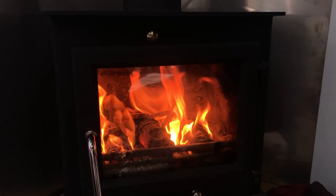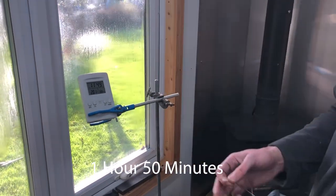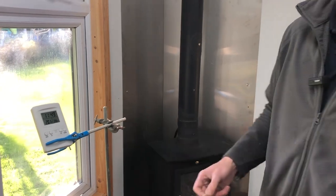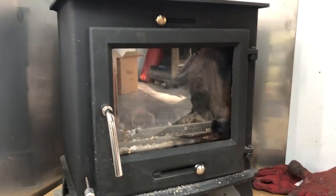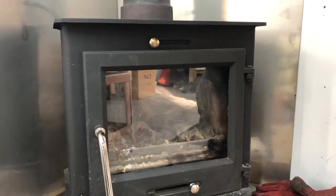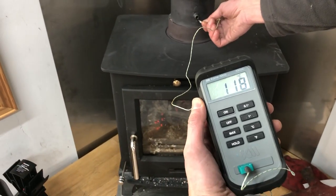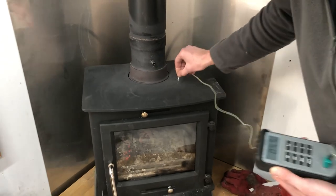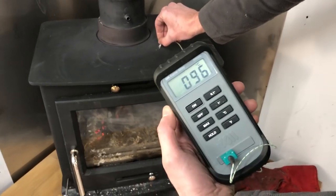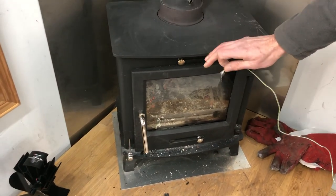Another reason the Ricoh is so much more effective: nearly two hours after that initial burn — just three logs and 320 grams of kindling — there are just embers in there, chugging slowly away. The temperature here is still 120 to 130 degrees on the stove top. The stove is cooling through the flue — the flue is at 80 degrees.